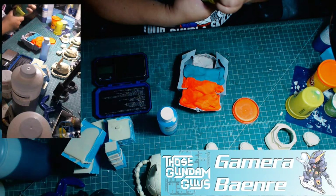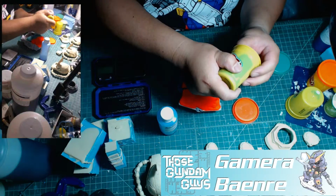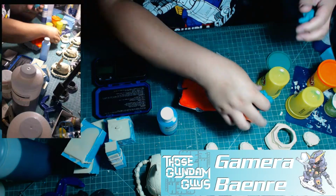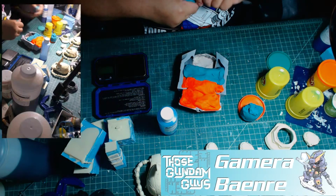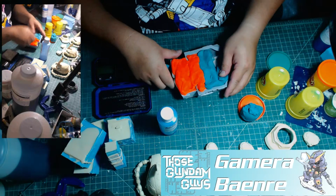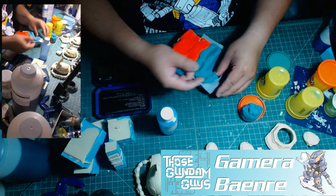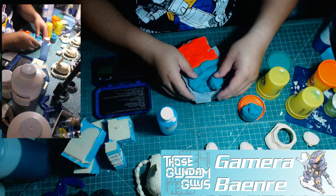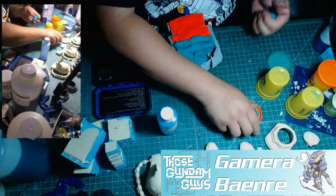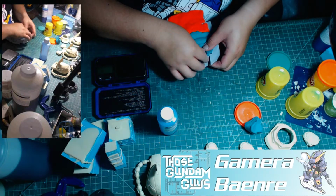So I got 4 sets of Play-Doh. I don't really care if the colors intertwine. I'm more concerned with just filling this cavity here. Because the silicone's going to be under about 40 pounds of pressure, I don't want the silicone to seep under here and start causing problems. That's why I'm filling this cavity as best as I can.